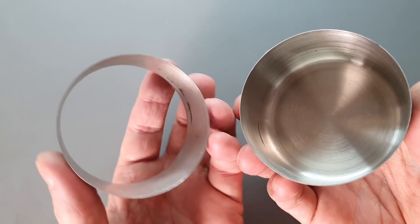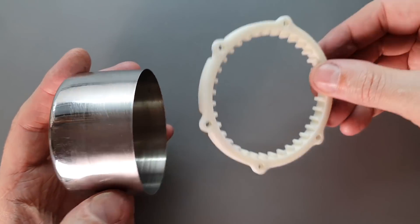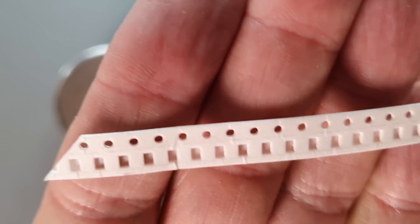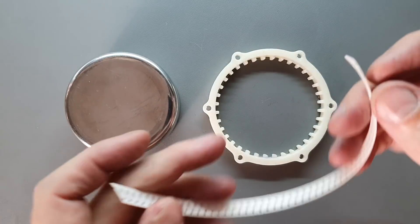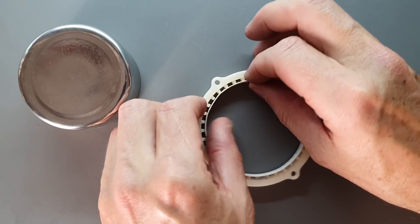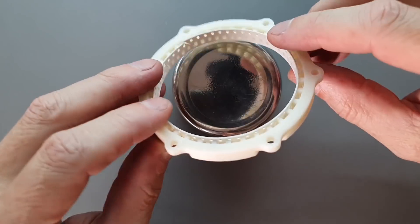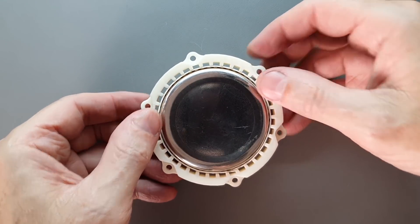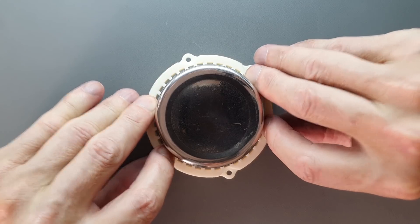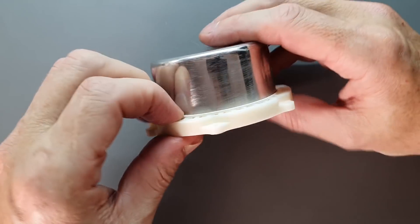The simple cylinder serves as the cold part of the engine. One of the key design problems I had to solve was figuring out how to mount the hot cylinder head into a plastic assembly without it immediately melting at the interface. I found surface mount resistor feeding tape, which is a really good thermal insulator and resists high temperatures. I wrap a strip of this tape around the base of the cylinder head and glue it into the 3D printed retaining ring with high temperature silicone adhesive. The retaining ring is also relieved with teeth to reduce thermal conductivity between the joint and the rest of the plastic.